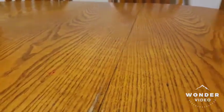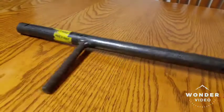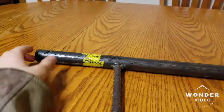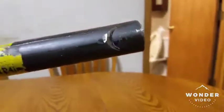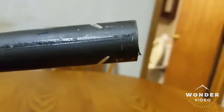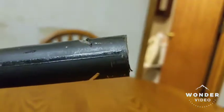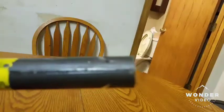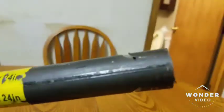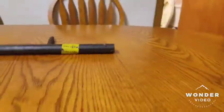Okay, so right here we have the barrel. As you can see, nothing much really changes the barrel besides this. I cut off the front and I made a little muzzle brake there. That is supposed to let the gases escape backwards so that it will push this forward, reducing recoil. I don't know if that will work right now on this.